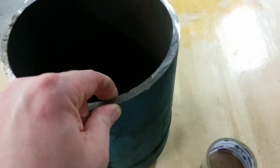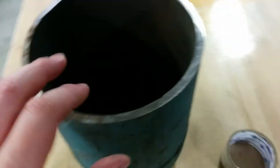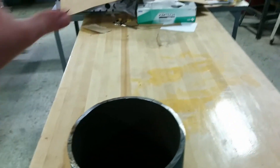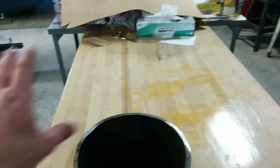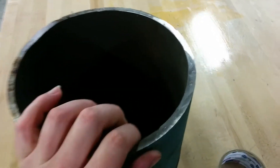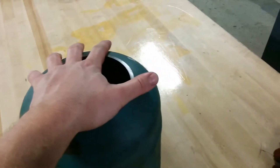I like the thick shell — once I heat it up it's going to hold the heat, and the odds of it deforming are pretty slim. I need to make this a half-size crucible. There was a top half with a bunch of cast iron pipes that I cut off to make it useful, and in the bottom was a drain which I cut off. I chucked it up in the lathe and cut that drain off.